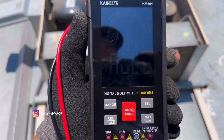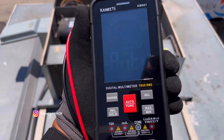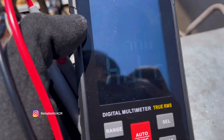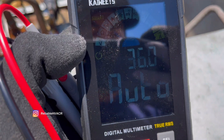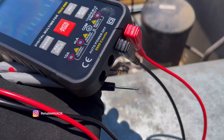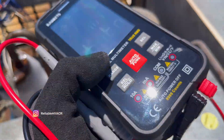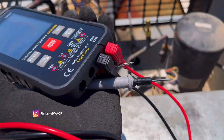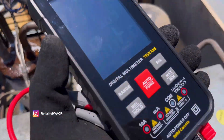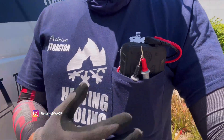It's decent in the sun, it's not the best. Basically it's because they used a black background instead of a white — if it was white with black lettering you'd see the contrast a lot better. It is a beautiful display, but it's something that's appreciated more indoors. It's usable outdoors though. The only thing you cannot do is amperage readings, so if I wanted to check a compressor or a motor for amperage, you can't do that with this meter. And as you can tell, it fits nicely in my shirt pocket.